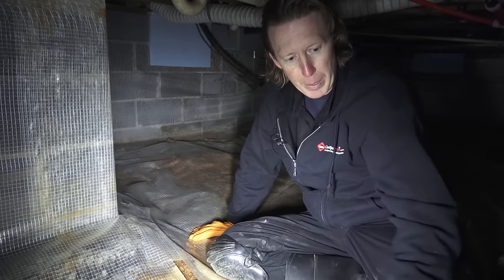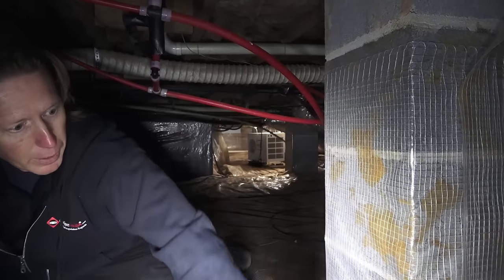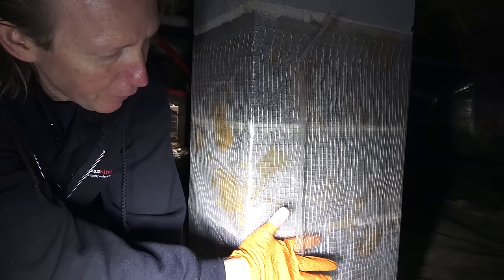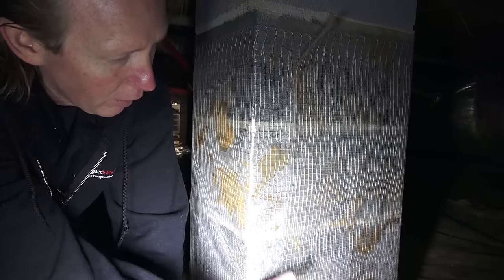Then we pan over here at this pillar. You can see all the moisture building up behind the pillar — all that condensation behind it, so all that stuff's evaporating. They didn't wrap these properly. They didn't tape it. So moisture's coming from probably underneath the plastic rising up. They did glue it here, but look at that — it's already starting to fall. The adhesive — I can stick my finger in there. Either it's already given way or they just didn't put the right amount of caulk on it. So anyway, there's a lot of issues in this crawl space.